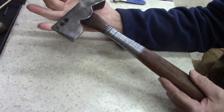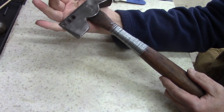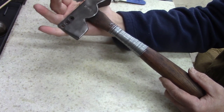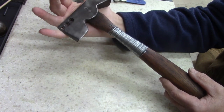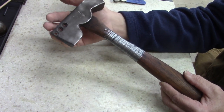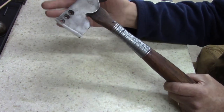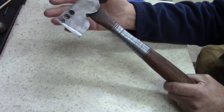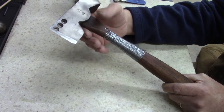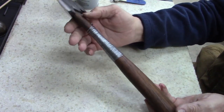I was tearing out part of an x-ray wall. For you guys that don't know a lot about sheetrock, in your x-ray rooms, where they shoot x-rays, the back of the sheetrock's lined with 1/8", 3/16, depending on the direction of the x-rays, depending on where they put lead on the back of the sheetrock, and it goes up 7 feet. And I had to tear out some sheetrock, and I could have used this to tear out some of that sheetrock. This would have made a great demolition hammer.